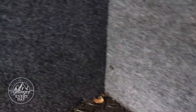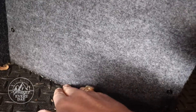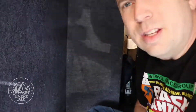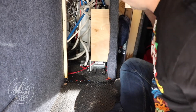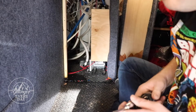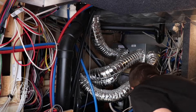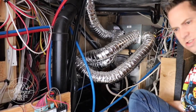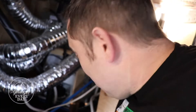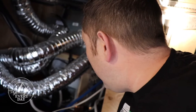We just got our basement cleared out and there is water along the edge of our walls here in the basement — that is not good. I'm gonna go ahead and take this panel off and see if we can figure out what's going on. We've clearly got some water in there. I can hear it dripping but I can't see where yet, so I'm gonna have to take this panel off too. Yeah, I'd say we got a problem with our water heater. We've got a lot of water — that could explain why we didn't have hot water this morning. So we've got a nice active drip there. Now we know we have a big water leak coming off our water heater, and when it wasn't working this morning I thought we could have a failed check valve. I think that's pretty obvious now — we certainly have a bad connection, so we're gonna have to replace it.